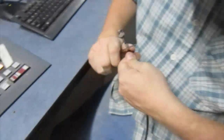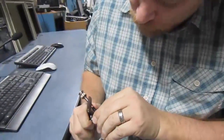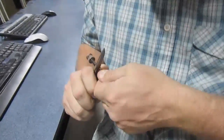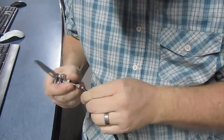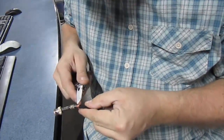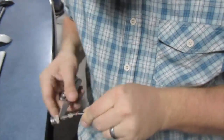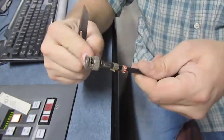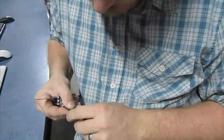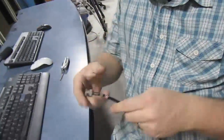So Todd, I had an idea. You had an idea. Our issue is that we are transmitting, and the ground is connecting on both sides. Right. And what you did essentially by pulling the pin was isolate the ground. Right. What the ground connects to is through the shield on the coax. So you're compromising the shield. Not entirely. I'm compromising it on one end only. We'll still be shielded all the way up to this point. This is the only point that won't be shielded. Well, it'll actually be shielded from here to here, so you've got one little tiny piece. It'll drain the other way, is basically what you're trying to do. Because you're basically turning the shield into an antenna. But yeah, we'll see if it'll work. I mean, I got no complaints.